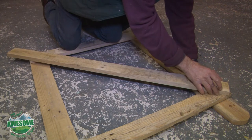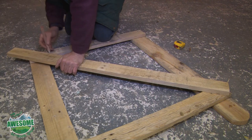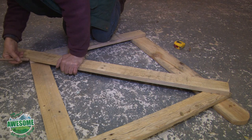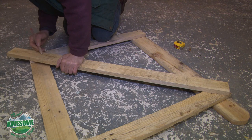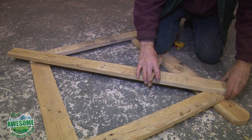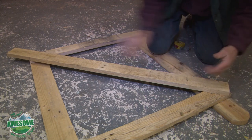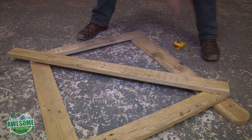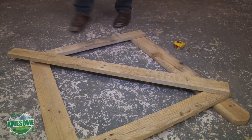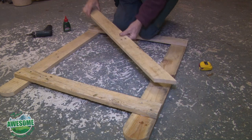And it's up to you to then mark across there where that flat edge is going to be, because that is the angle you want. I mark on there, I come up the edge here, over the edge of the wood there, and then get my set square in a minute, and I'm going to draw across there, which will make sure everything is square. I don't want those other bits sticking outside. I join those two up, and that will give me the angle cut. And as this is the inside, I'm just going to put INS inside, otherwise I might get the angles mixed up. Right, I've got my angle cuts there, you can see, at a slant.